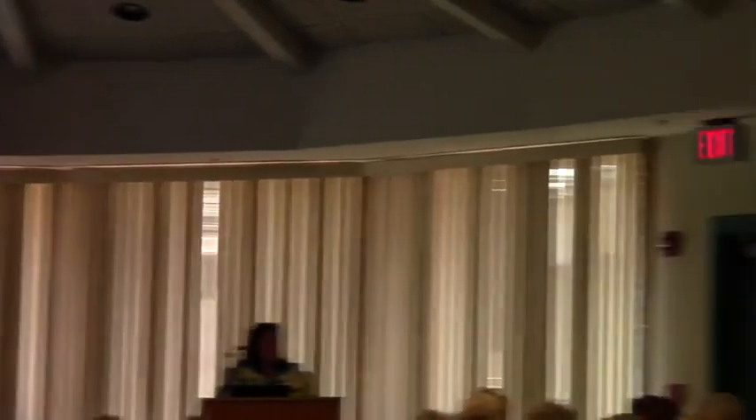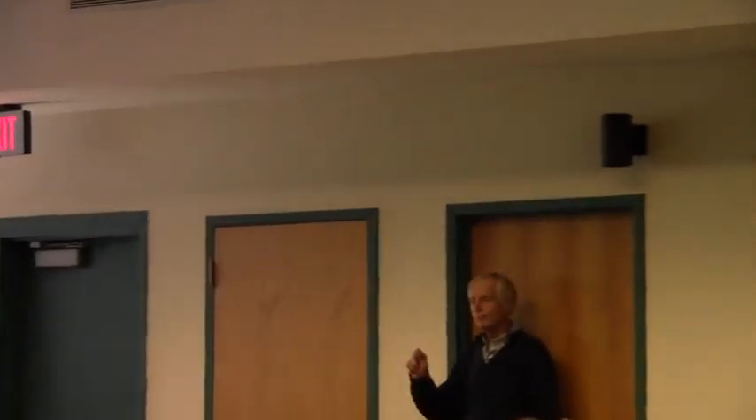Craig explains: these panels are an eighth of an inch thick — it's an amorphous thin film. It's a peel-and-stick product placed between the seams. It's not as efficient on a per-square-foot basis as a crystalline panel — about half — but on a per-watt-generated basis it's a little better. They take a little more room and are a little less efficient, but more practical. The other neat thing about amorphous thin film is it works on cloudy days — it'll even produce a tiny bit of electricity in low light.